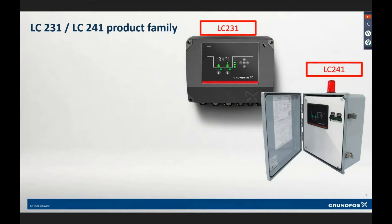We're just taking it and building a modular style panel versus a wall mount style panel. The wall mount style panel, the LC231, is a NEMA 3R enclosure. Although you could mount it outside, we recommend you still cover the box. The LC241 is a modular style panel in a Type 4X enclosure, with standard features you'd see at water utility stations — a solid outer door, an inner front, beacon light, external buzzer, things like that.